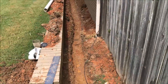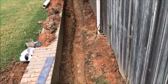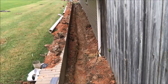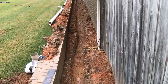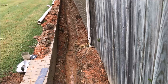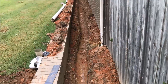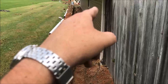An important thing to remember whenever you are installing a drainage system: your first 10 feet — preferably your first 20 feet, but absolutely your first 10 feet — should have the maximum slope allowed for the site you're working on. If you do that, as you continue to work your system down to the discharge area, you can start to level it out. If you have a 3% slope in the first 10 to 20 feet and then start to level your pipe out, you're going to get really good water movement through the system and still get good water push out. Get as much slope as possible in those first 10 to 20 feet — and that's what we're going to have to do here, because down there, that's as far as we can dig.